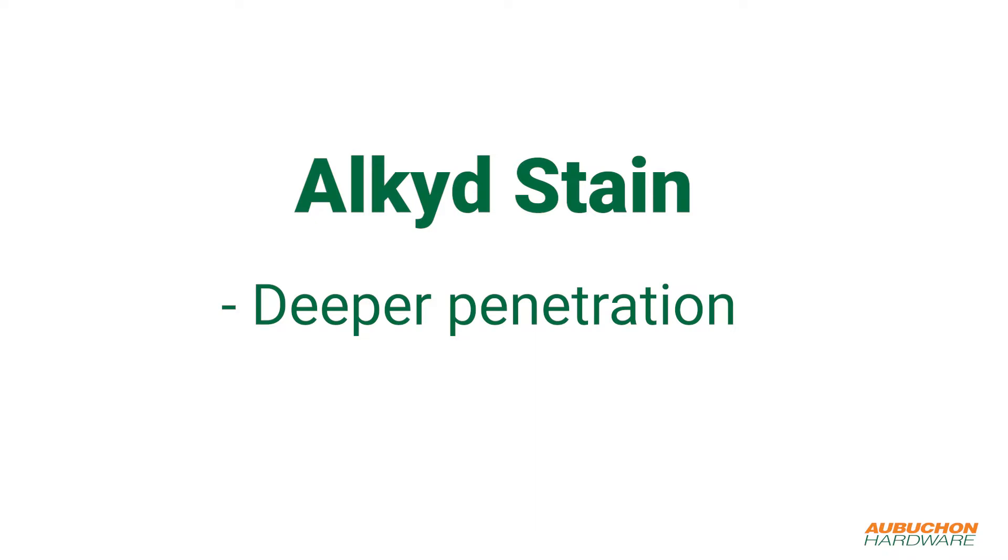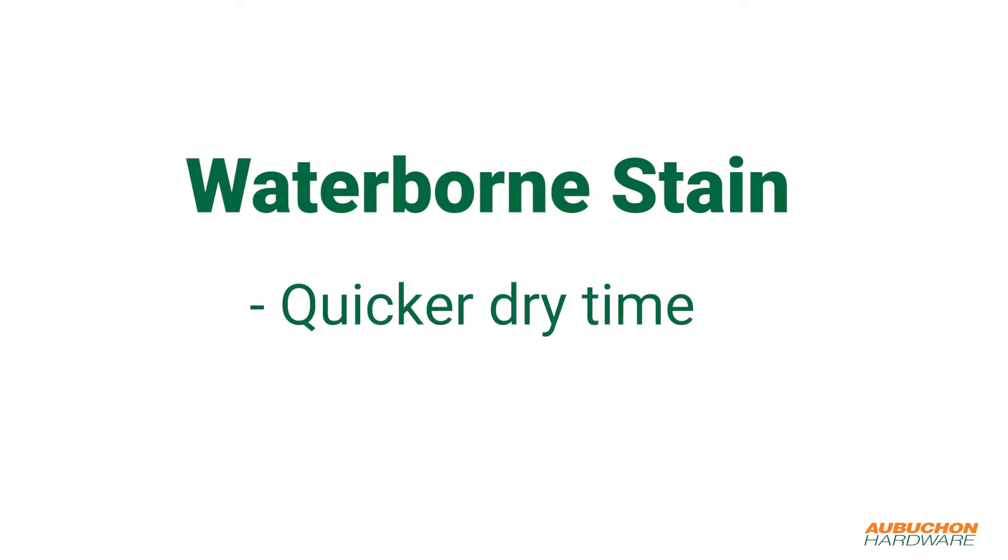Sure, John. When a customer comes up and they want to know their options, we let them know that we can go up until the solid — we can go with either waterborne or an alkyd stain. Some of the differences are: your alkyd stain is going to penetrate a little bit deeper, your color is going to be a little bit deeper on that wood, whereas your waterborne is going to dry a lot quicker. You're going to get back onto it quicker, and it's going to be a little bit lighter. For years, the stains were all oils — all deep penetration — which required thinners, thinner rags, all the byproducts involved with an oil product, which were hazardous sometimes. With our new modern waterborne Arborcoat stains, we have some great bonds, some great hide, great representation of color. Our oils are still there for our softwoods.